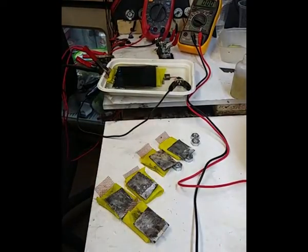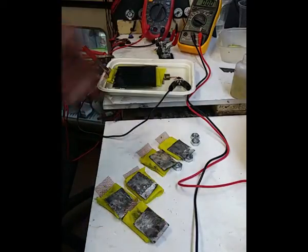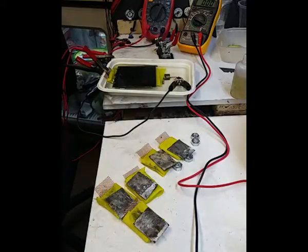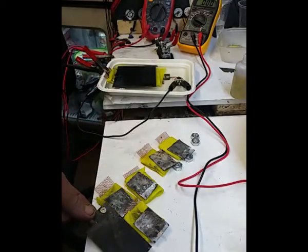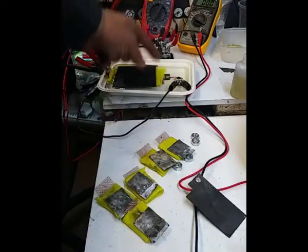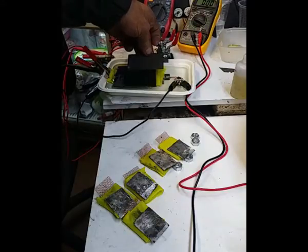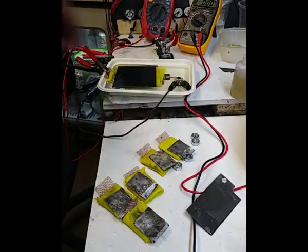Now I can see that it's got obviously a larger piece of copper as well, and the full-sized piece of magnesium. If I can show you, I'll find one. I've got these in water so they don't degrade too much. So that's the size of the magnesium compared to that, which is about half, I think. So I've doubled the size in there. That's one of my other plates for my seawater battery, as you can see, and that's what's in there. So that is healthy current, look.